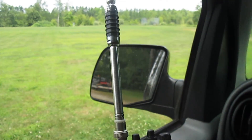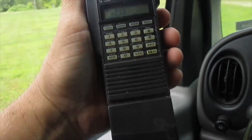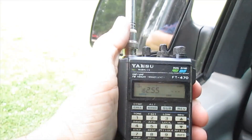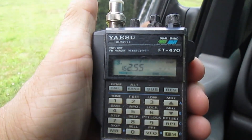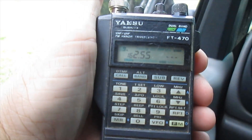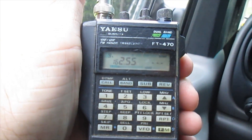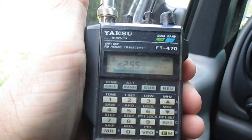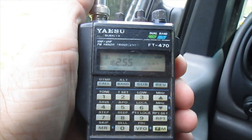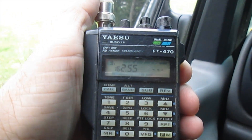This one is too, but there's something different about this one — it has a loading coil and it extends. What I'm going to do, rather than demonstrate on a ham band, is show you the weather band, because it'll be easier. If you look below 162.55, which is the frequency the weather band is on, you'll see a little jumping display below it. That's the signal strength. We're going to put out more antenna, and as we do that, we'll bring it to the resonant length for this frequency, or close to it, and you're going to see the signal change.